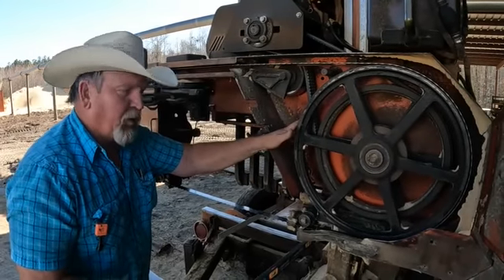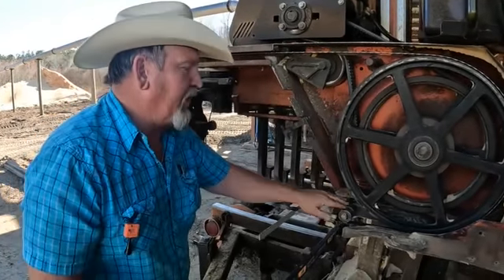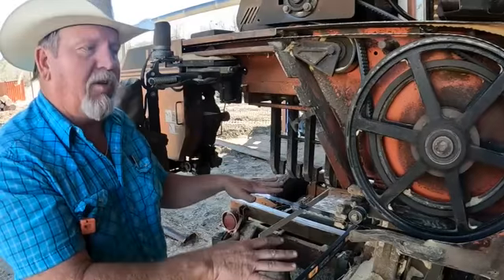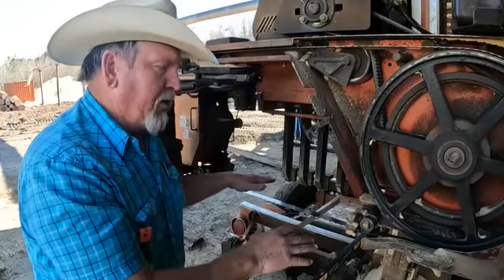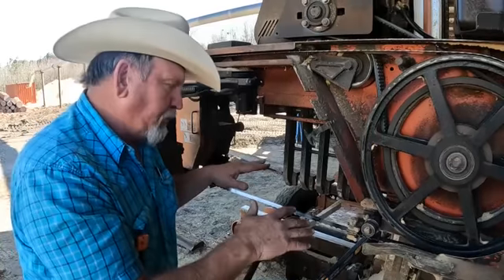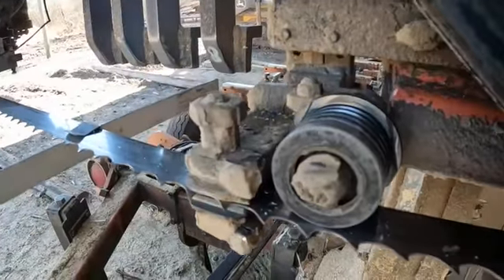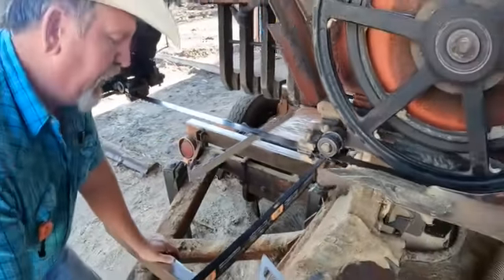You want to make sure that your belt is adjusted on a regular basis. When you put a brand new belt on, within 20 hours you are going to need to adjust that belt. If you don't, it is going to be losing traction or grip. As it starts to lose grip you're going to start to lose blade speed, and once you start losing blade speed you're going to start getting poor quality cuts. It doesn't matter how sharp your blade is — if your belt is not at proper tension, you're going to get poor quality cuts.